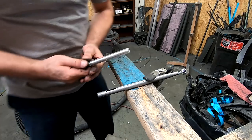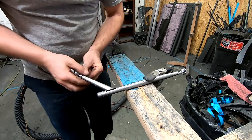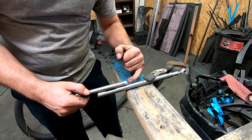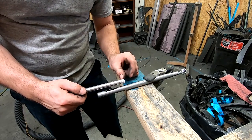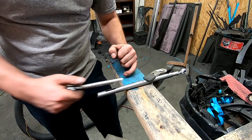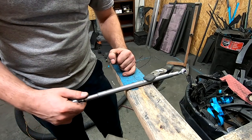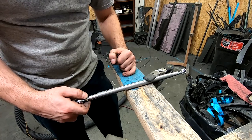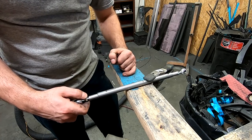We just shortened this a little bit — the spring is still inside. If you ever cut this too short you could almost space it back out by shimming it with some washers or a nut in there to hold that tension.